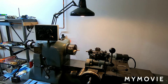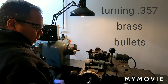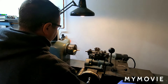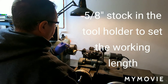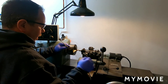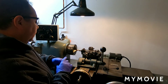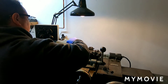I've got this job pretty much set up. I'm going to run through one or two of them so you can see the process. Station one — let me turn three-phase power on. Station one is just to run the part in. I should actually have my collet set up on here. There's my stop, and this is where I have all the stops set. Station one is just to run the part in and give me a positive stop on the part to set my length.